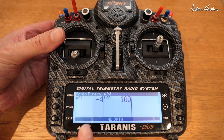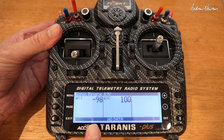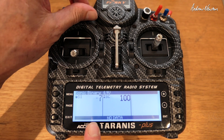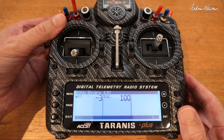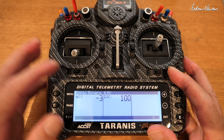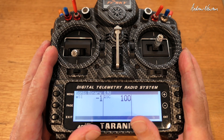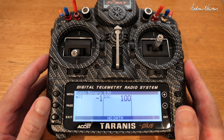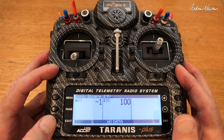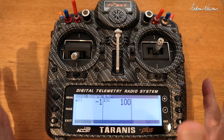Now get out of that. Let's have a look at the display page: minus four, so the S1 is on minus four, and that's what Amber's telling us — minus 98 — and the same with minus 98. So there you go — there are two methods to get the value of a pot, a slider, or whatever switch you choose while you're flying: either audio or by looking at the display screen. Thanks Sandy for asking the question, thanks for watching, and we'll see you again soon.